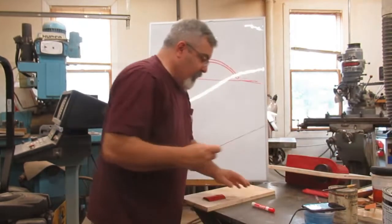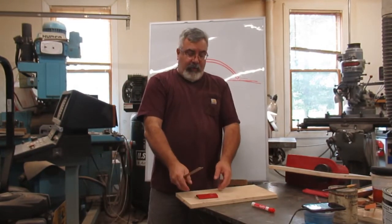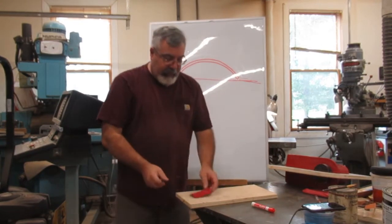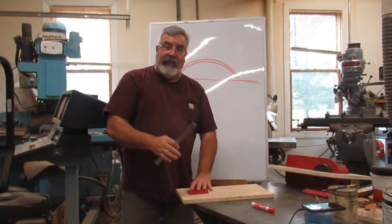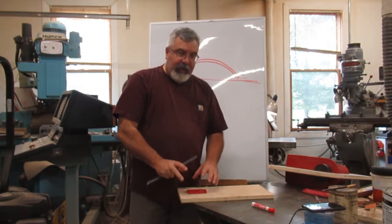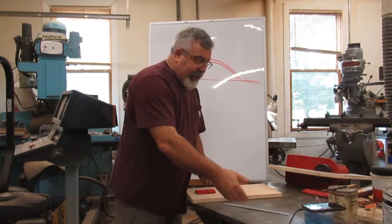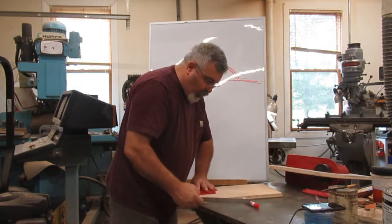Okay, this is a pattern, it's an aluminum pattern. We use 3/16 shrink for this. However, when I'm doing this, you can use standard because it's going to be what it is. You know what I'm saying? So it's not going to shrink or anything. It is just what it is. So I mean, either or. It's got my standard rule here.